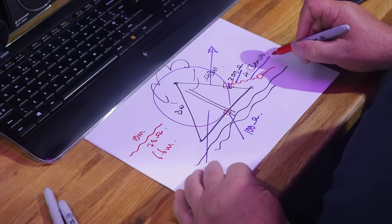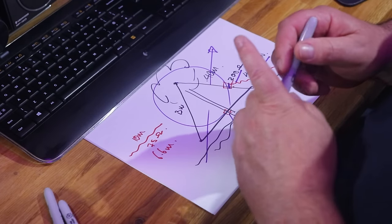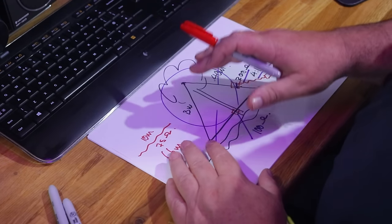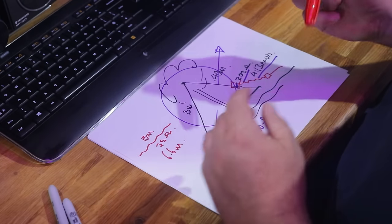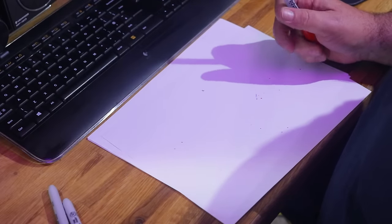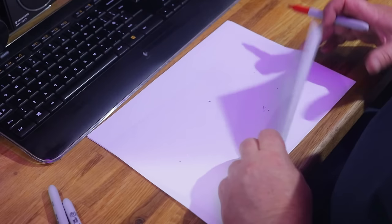That quarter-wave 75-ohm stub would transfer the impedance — someone in the comments will tell me if I've got that wrong, I'll pin the best answer. If you go the 75-ohm coax route you're definitely into a mono-bander. If you use a 4:1 balun then it would work on multiple frequencies — every harmonic. So if you get a tune on 40 meters it would also work on 20, 15, and 10 meters. Those are the two ways of erecting a Delta Loop vertically.